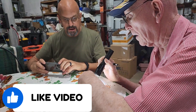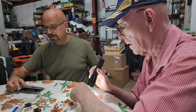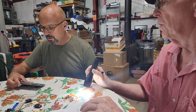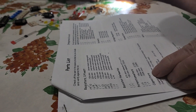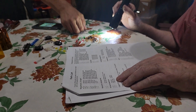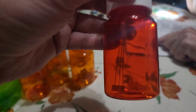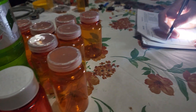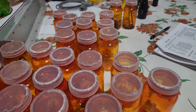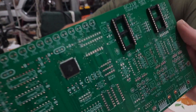Now we're doing an inventory of all of the parts. This took us probably a good 15 or 20 minutes because you need to read the bands on all of the resistors to make sure you have the correct ones, check your capacitors for the right capacitance, the ICs, the chips, and everything. What AC4DM has always gotten in the habit of doing is not only checking everything off to make sure we have everything, but as we inventory all the parts, we put them in little pill bottles so they're isolated and easy to access. You can see we've got resistors in each little bottle — this keeps everything separated and easy to locate. These are all the pill bottles of the various parts — lots and lots of bottles — but as you'll see when we get to the end of this video, we will have used about a third of those.